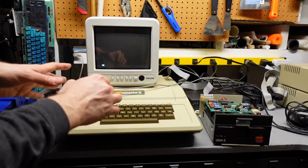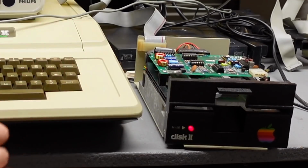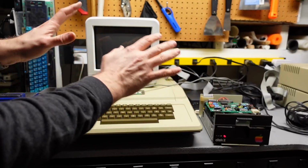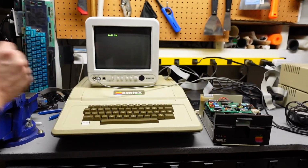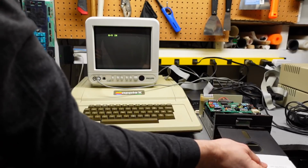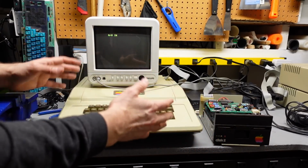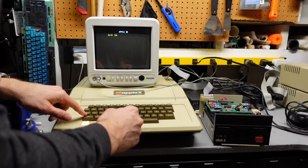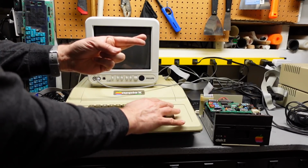Now the Floppy Emu is on slot 6, and I'm going to do PR#5. Okay, it sounded normal. So I'm going to pop a disk in there. Let's just go for broke, see if this thing boots. I have a copy of ADT Pro. It's a ProDOS disk. Regular games and stuff, they don't like to be on slot 5, but ProDOS should have no problem booting off slot 5. So turn this back on. PR#5. Here we go, fingers crossed.